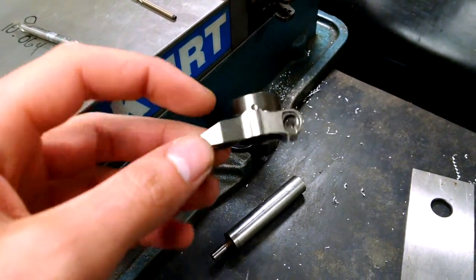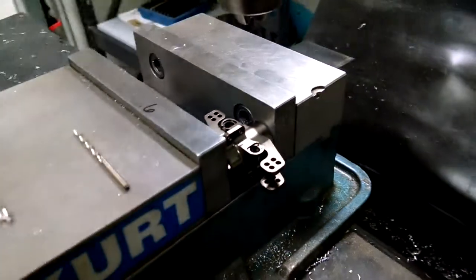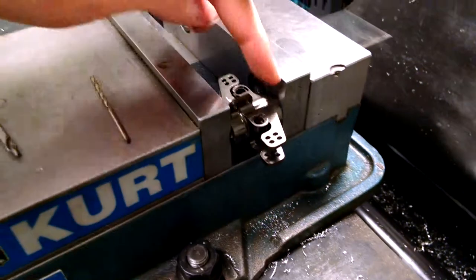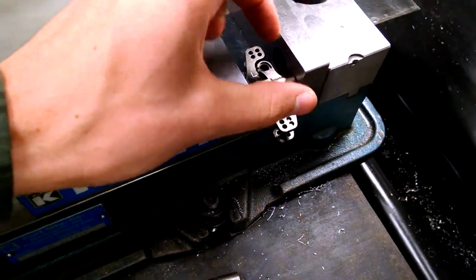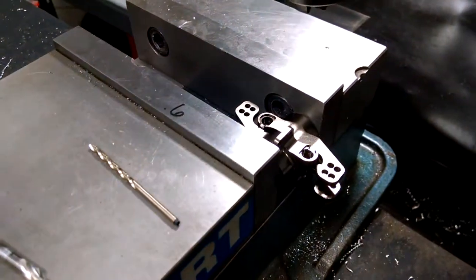Putting the holes in these uprights — see the rear uprights? You kind of have to hold them like this because they're an odd shape. Basically just measure 6mm from here, and that circle is 22mm, so you go 11 over, put a hole, and you're good to go.